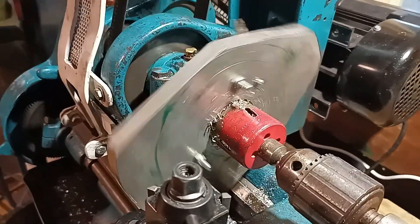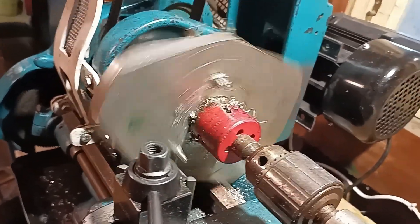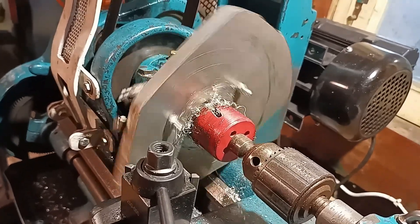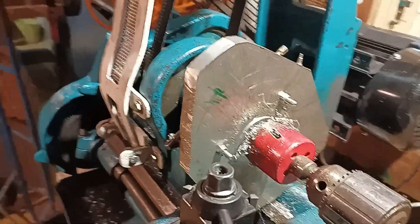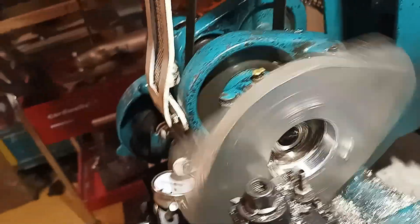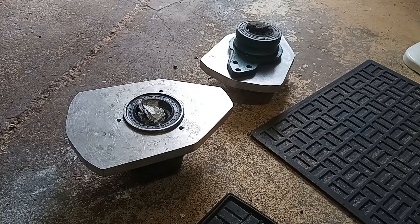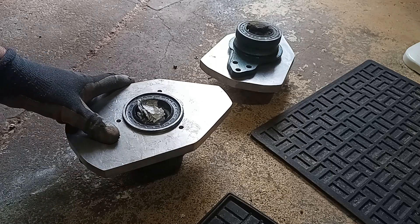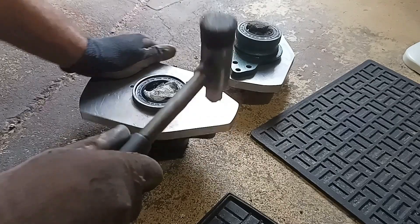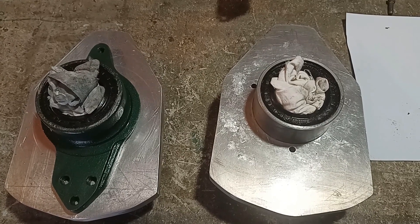And now we go for super ugly. We now open it up to the diameter to accept the hub, cutting about 15 thou at a time. The technique for getting the upright onto the hubs is quite medieval. Tight fit though — so far so good.